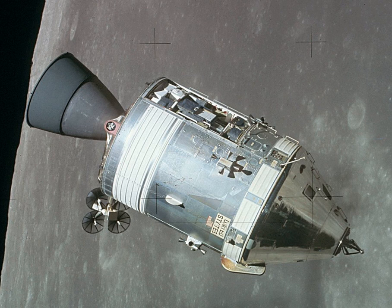The capsule was steered by rotating it using thrusters. When no steering was required, the capsule was spun slowly, and the lift effects cancelled out. This system greatly reduced the G-force experienced by the astronauts, permitted a reasonable amount of directional control and allowed the capsule's splashdown point to be targeted within a few miles. At 24,000 feet, the forward heat shield was jettisoned using four pressurized gas compression springs. The drogue parachutes were then deployed, slowing the spacecraft to 125 mph. At 10,700 feet, the drogues were jettisoned and the pilot parachutes, which pulled out the mains, were deployed. These slowed the CM to 22 mph for splashdown.